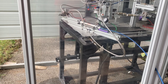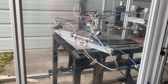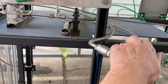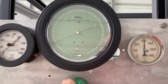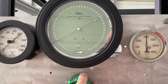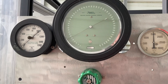If we shut that down it should reignite. By adjusting our supply pressures we can change the relative combustion characteristics — we can raise this up a little bit with the dome loader or lower it down. As we lower the supply pressure we get a leaner mixture, though it's still running pretty fuel-rich, which is what we want.